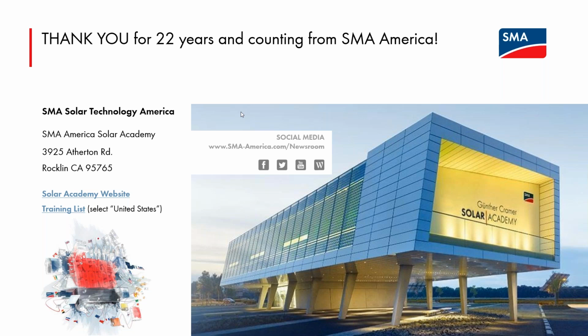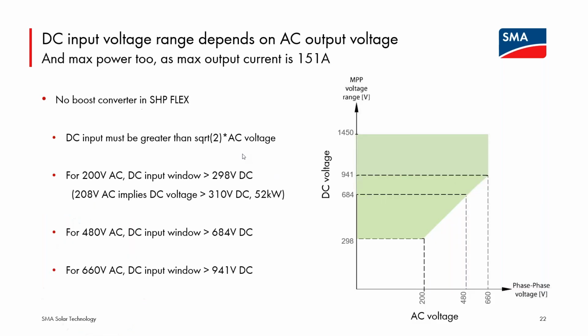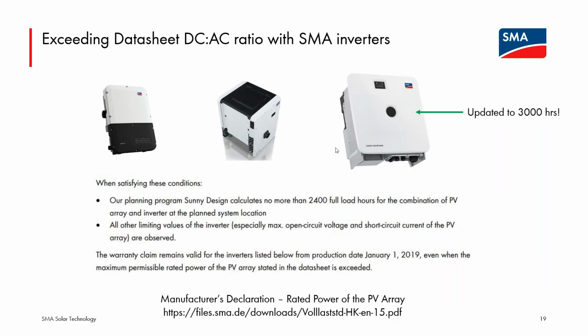Great. For Highpower PEAK3 inverters, are there any plans to include AFCI in the US 21 models or future models? I don't believe so, and a lot of that has to do with the architecture of the unit. My understanding is that it is impossible to find AFCI detectors that can work over 40, I believe it's 40 amps. It's some number that is significantly less than the amperage input of the PEAK3 based on its architecture.